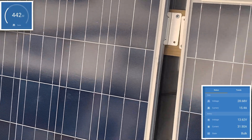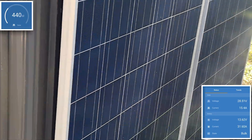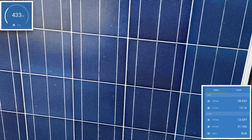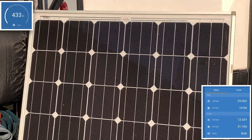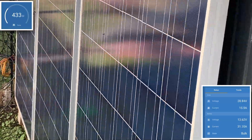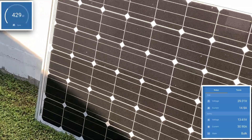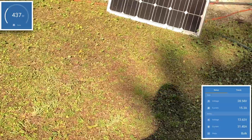As you can see, we're at 400 — 450, 435 watts. These are running parallel. What I also want to try here is put two of these in parallel and just run them into the solar shed to see if I can add another string, so I might try that — just add two more of these panels in parallel.